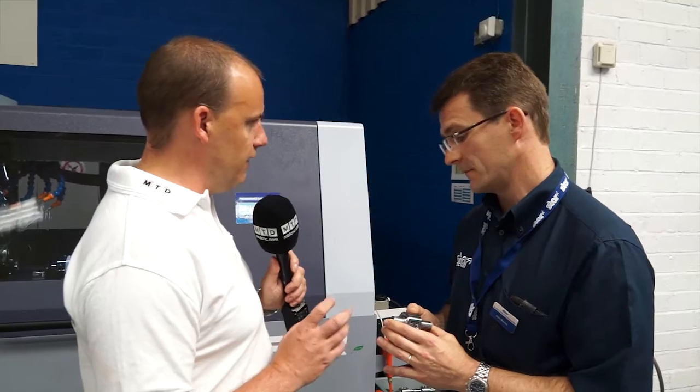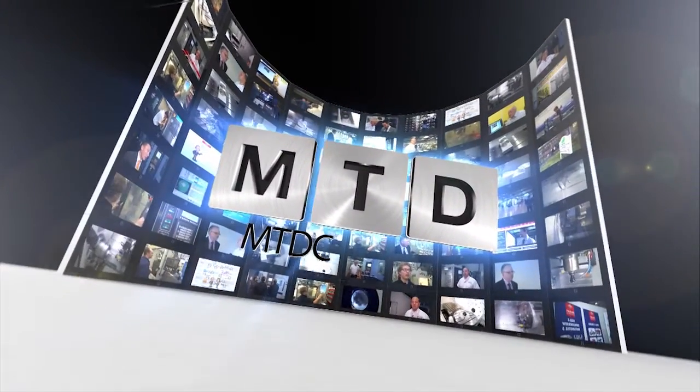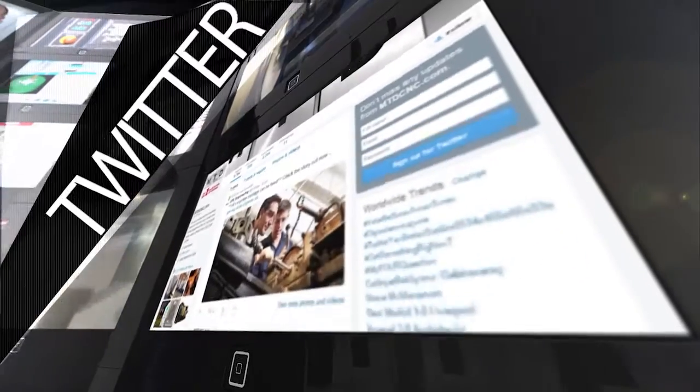This machine also has a turret as well as platens. On head one we've got platen and turret, so we can mount an awful lot of tools — the turret gives us ten stations and we can mount three tools per station in a lot of cases. There are a lot of twin-turret, twin-spindle machines in the 42mm class, so we needed to show that our slider has that capability. With the turret and the B axis, it gives us a very versatile machine tool to do such parts. Alec, thank you very much for your time today — we've learnt a lot. For more videos, products and news, go to mtdcnc.com or follow MTD Online on Twitter.